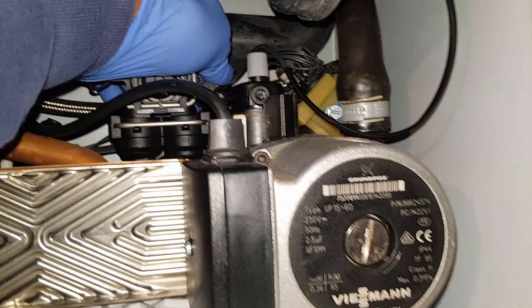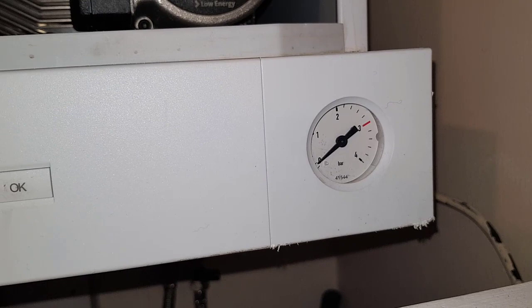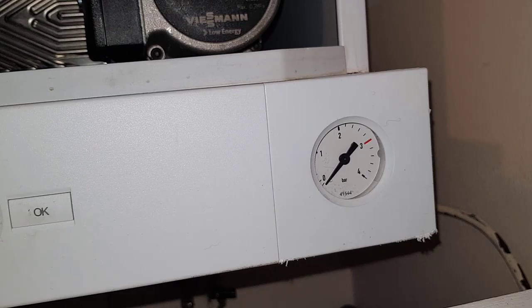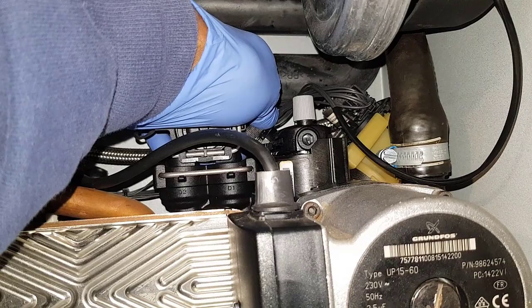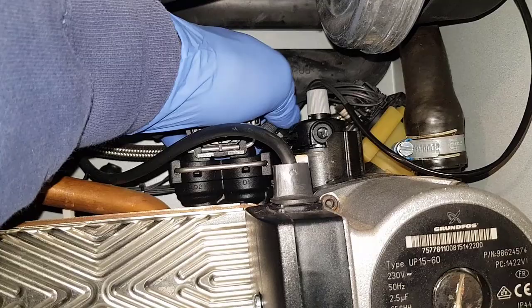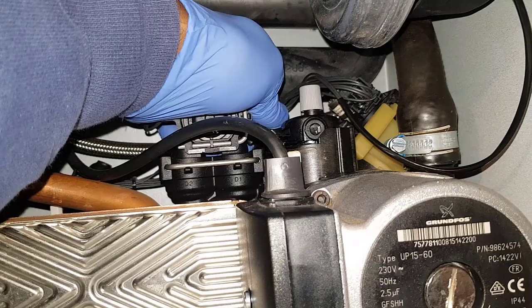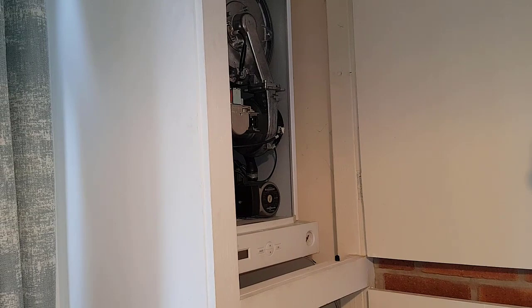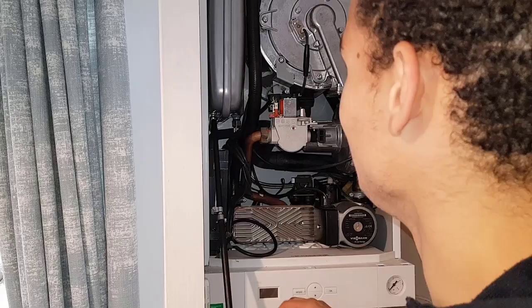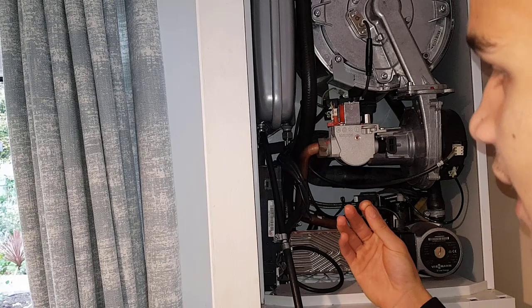It's making all noises because it was very hot inside the boiler. The pressure's going down. Kind of got a bit of bad wind in there. I'm just trying to keep it clamped open — it's really difficult to get it at that point where it just stays open, it's very delicate, because when you turn it, it flicks back round. We've got most of the water out. Now we're going to be changing the pump. Because we're working on the primary side of the boiler, I'm going to connect my foot pump to the expansion vessel to get rid of any remaining primary water from the system. After connecting the foot pump to the Schrader valve, water came out, which means the expansion vessel is knackered because the diaphragm is split inside it.